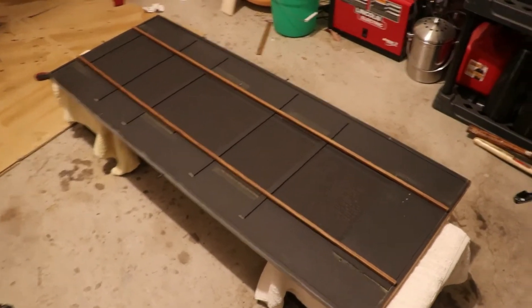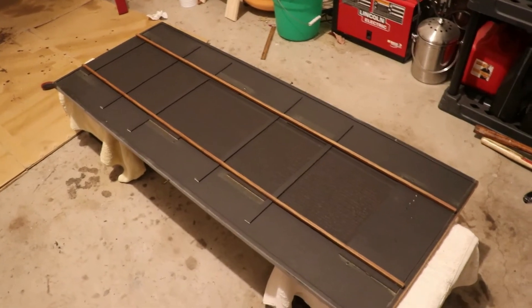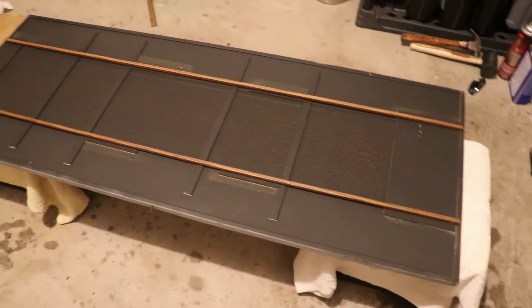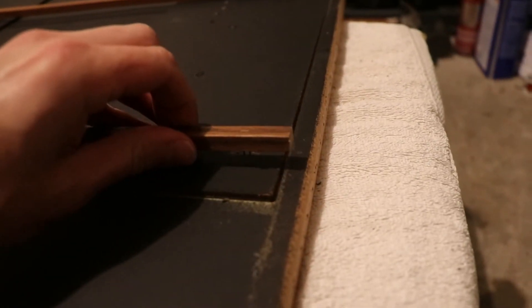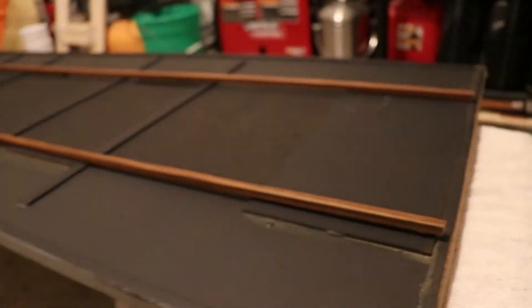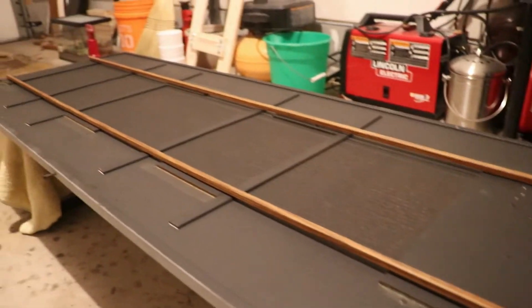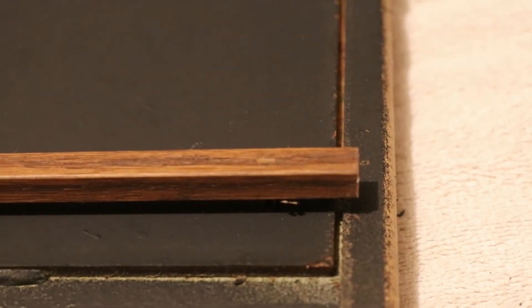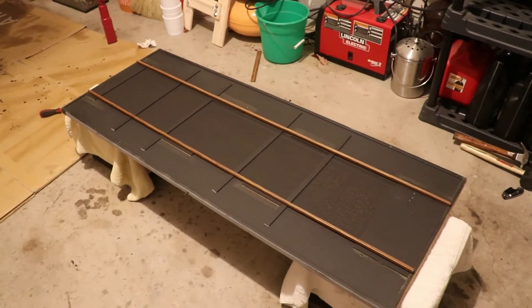It's a brand new day now that the wire is soldered and everything worked out. It's time to get the speaker ready for reassembly. The first thing is to take your thin wood strips and figure out exactly where they were before they were removed — look at where the staples are and line them up with where they originally were on the speaker, because you can't just hammer them back in easily. Once you've noted where those strips are supposed to go, remove them and set them aside in a way where you'll remember their exact positions.